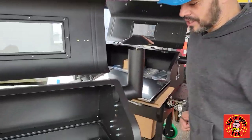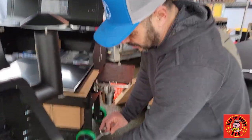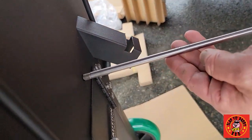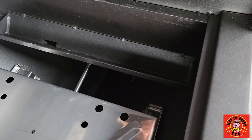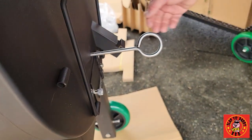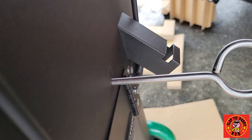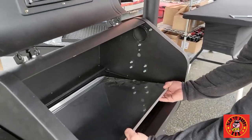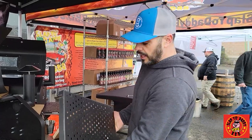Back here where you see the heat plate, you can change the temperatures — the easy installation for that comes like this: you insert it into that hole, it lines right up, and it's a couple of turns. Now you have accessibility to move the heat temperatures around. There are guides to let you know what setting is perfect — you can find that in the instructions. On the other side, you have a thermocouple, and you want to make sure that is uncovered when you install the plate.